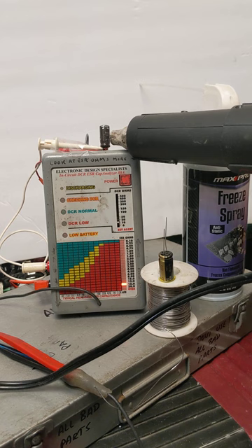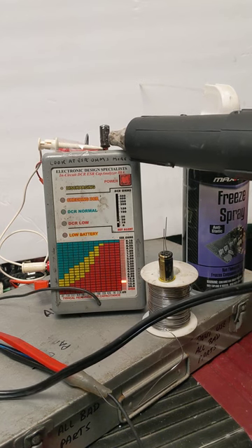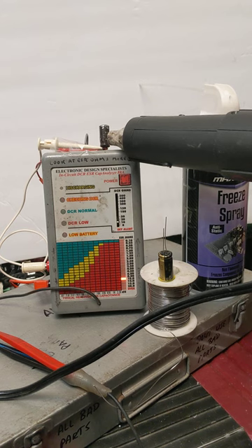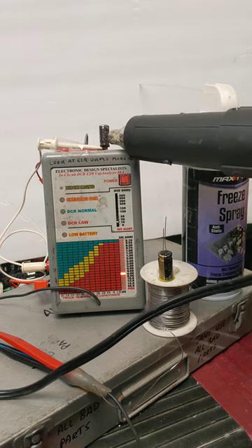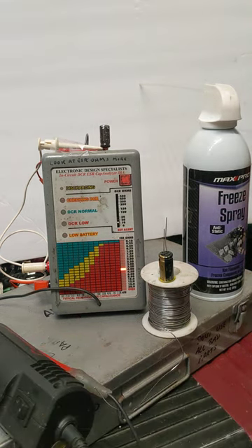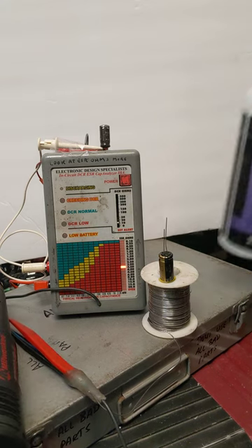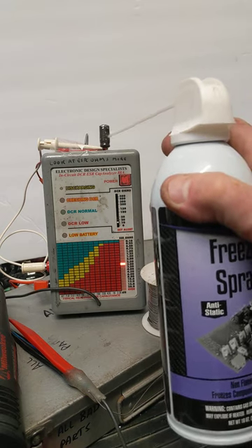Let's take a few moments to heat up. Let's say you had an intermittent problem on an electronic device and you wanted to know if the capacitors were the problem. This can be a useful technique — by warming them up, sometimes just long enough to get the thing to start working, it'll give you a good idea. Also, sometimes we freeze spray the components, and that would tell us if there was a problem.